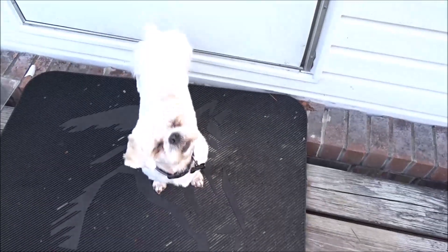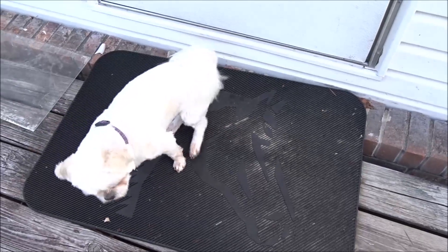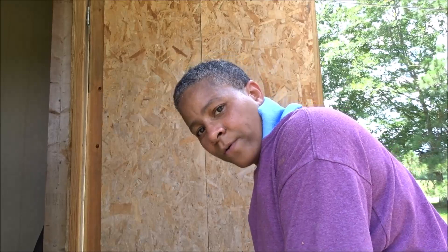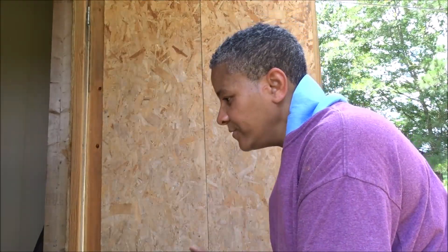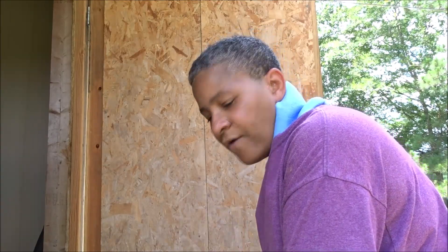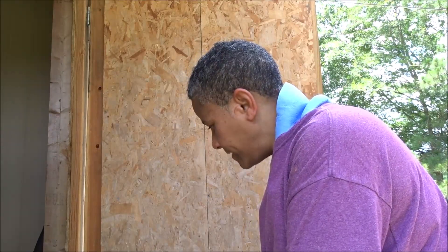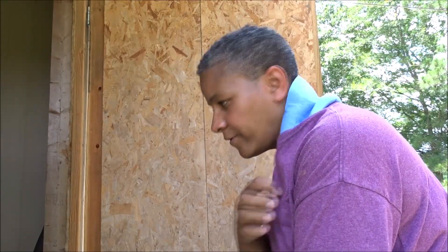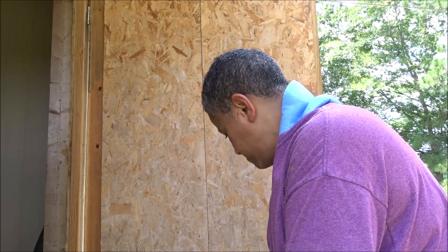You'll stay out here while I go work on the cabin. I'm gonna take this corner bracket that's normally used for drywall. I'm gonna put that around the outside, screw it in, and hopefully this is going to be a good base to put the foam door seal around on the outside to try and help keep the bugs out. Then I'll talk about what I want to do next.